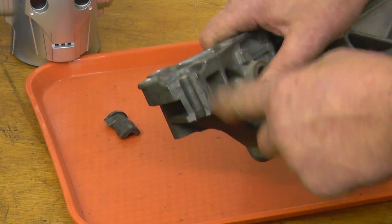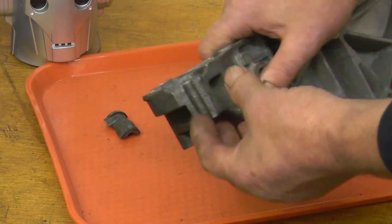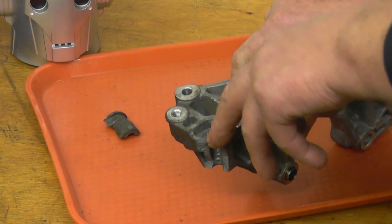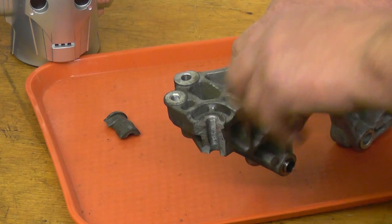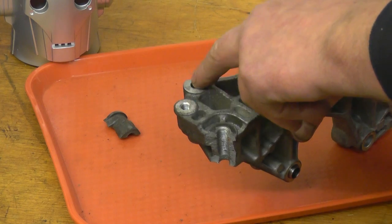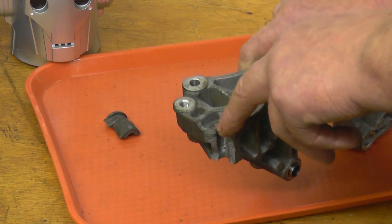What you've got to do is grind all this away, cut it all back to clean metal, build the lug up solid, re-drill it and tap it. The centre point of that hole is critical. So all I have to do is make a small jig for it. I can use those two holes there to pick up that hole with.